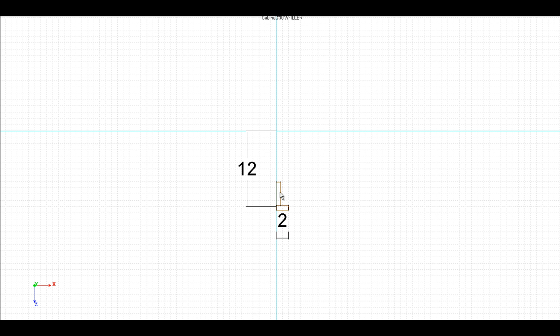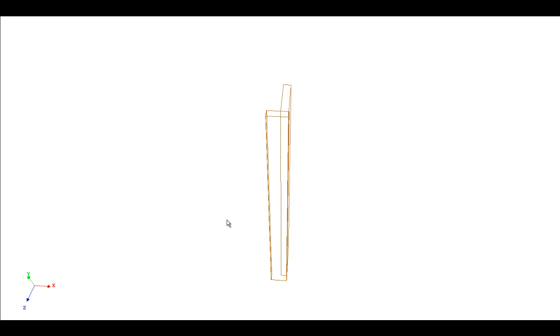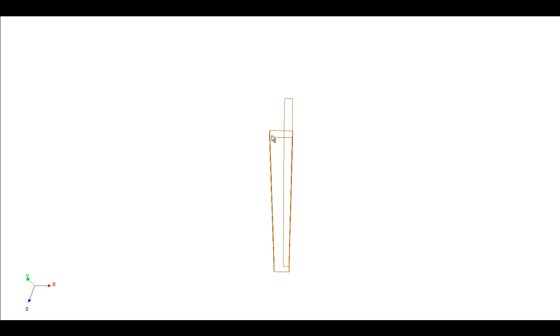So the idea behind a filler is that you're able to actually put the cabinets into the wall. Here you go, the wall is over here, and the filler is going to go into the wall. Now you need fillers because if you don't, and you're off by even a 1/16 of an inch, you're going to have either a very small space you won't be able to utilize, or you over measure and you have too much cabinets. Now you've got to cut a cabinet down, and that's going to be a disaster. So fillers are nice. They're just a nice insurance policy.